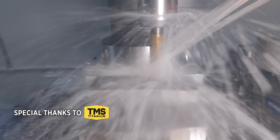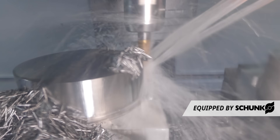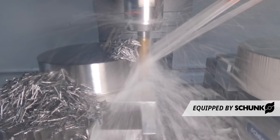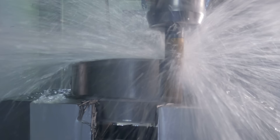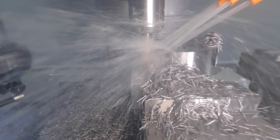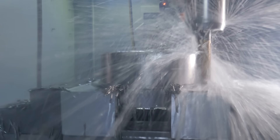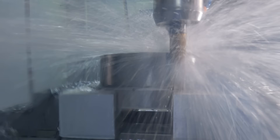Right now you can't even hear anything, and yet you can see that it's cutting and making a nice finish. That's all those flutes — with 8 flutes you have a bigger core diameter which keeps the rigidity in the tool. Our axial is 1.75, so we're all the way down, 10% radial, and that cut sounds absolutely beautiful. This is 250 surface foot — already higher than what they're telling you online. We're going to take more cuts and jack it up even faster.